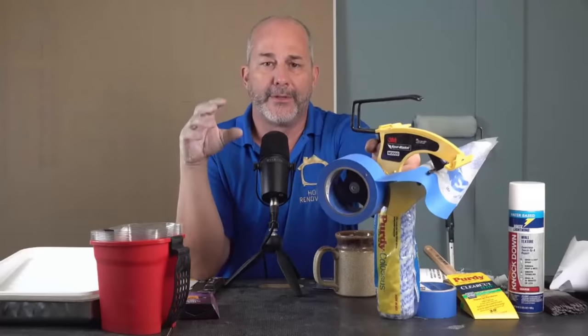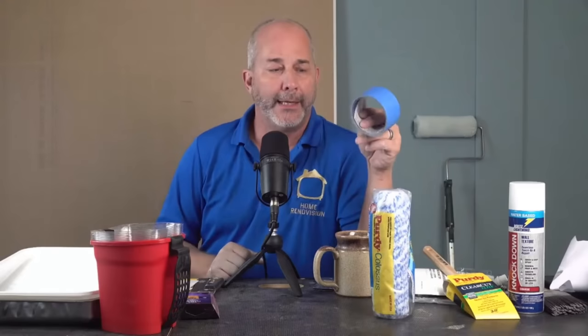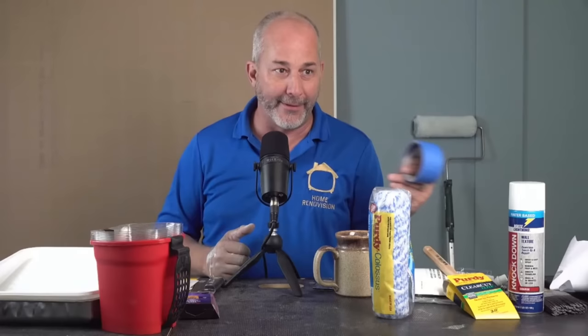At Sherwin-Williams you'll also find this from 3M. 3M is a great company — great chemistry, great adhesives and caulkings, great tape. This masking product is designed for masking jobs: you stretch it, cut it, tape it, and the plastic pulls down to seal up your project to avoid overspray when paint spraying. Remember, you don't have to buy blue tape — if you buy brown masking tape indoors with no direct sunlight, it'll work just fine at less than half the price. If there's a bit of sunlight and you'll only be there a couple of days, buy the green. Blue tape is for when you set it up and leave it for a week in direct sunlight. It's the most expensive and performs really well, but it's completely unnecessary in a lot of applications.